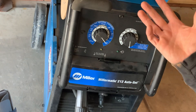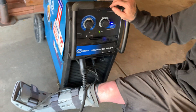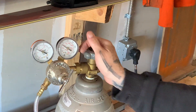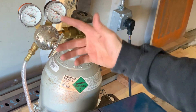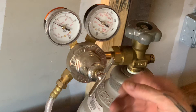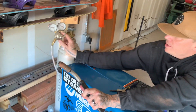So now if I was going to start this machine up — power switch, they're all going to be a little bit different, but this is straightforward. My power is on. Now I'd want to make sure I have my cubic feet per hour of shielding gas set. I'm going to open my cylinder of shielding gas. I can look at my high pressure gauge and I'm still in pretty good shape. Then I pull the trigger and I can see that needle pin back and forth, and I can adjust my CFH accordingly.